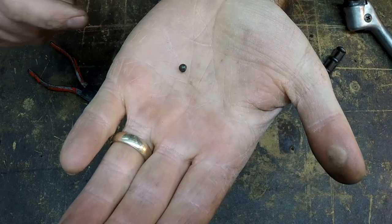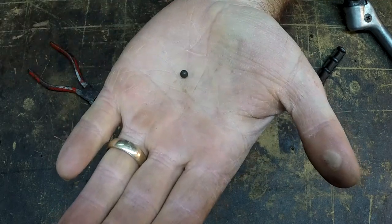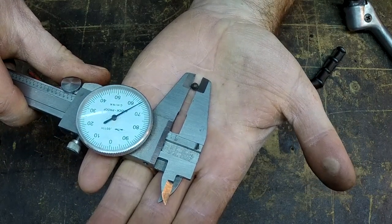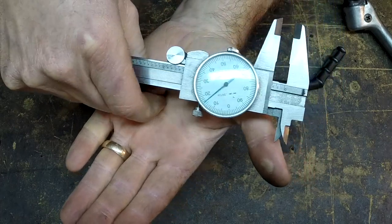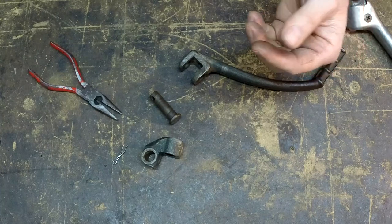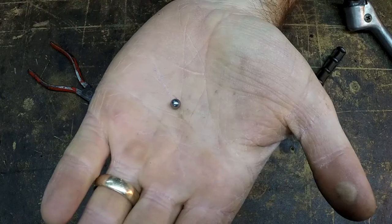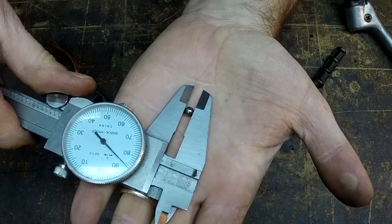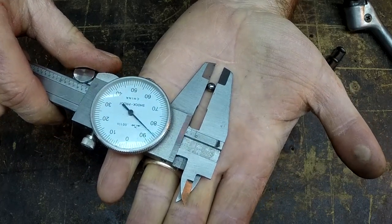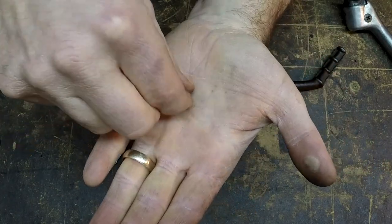That detent hole is a lot bigger than the little detent ball right here. You can see that. This ball is old and totally misshapen. Just for reference, if I measure that, it's about 165 thousandths in diameter — just on the part I measured, so it's kind of weird shaped. What we're going to do is replace it with another bearing, but this one's bigger — 186 thousandths. It's a little bit bigger, and this one is round; it's not all worn out.